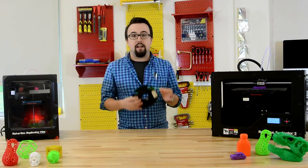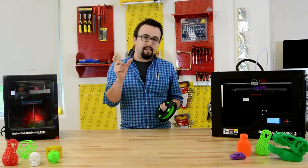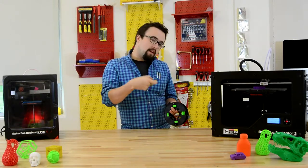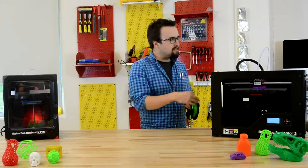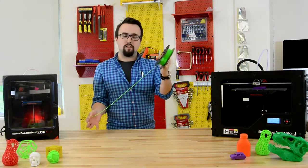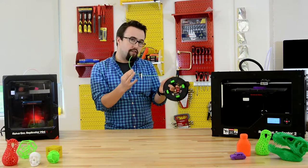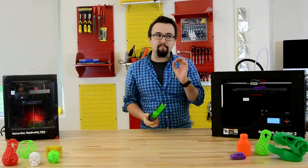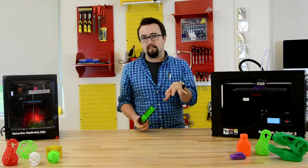What I like to call a 3D printer is a computerized glue gun. If you think about a glue gun, what it does is it takes up a piece of plastic glue, melts it down so that when it comes out of its nozzle it's nice and hot and able to stick to your project. That's exactly what the 3D printer is doing. Both of these printers are heating up what's called PLA plastic to 230 degrees, so that when it comes out it hits the cool build plate and immediately solidifies, hardening into whatever pattern you have programmed on your computer.